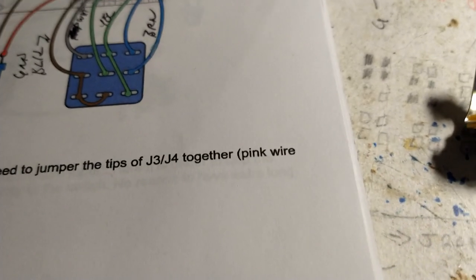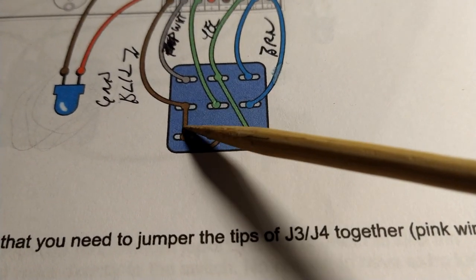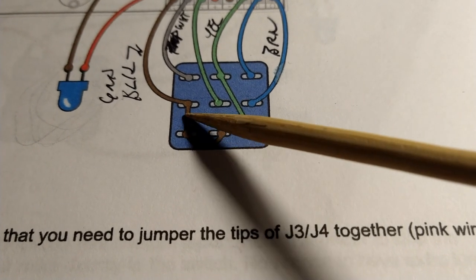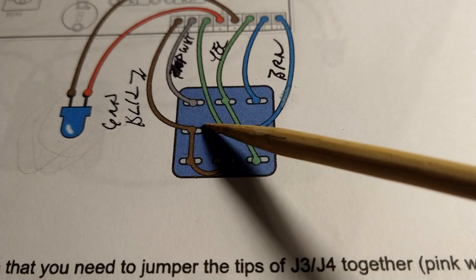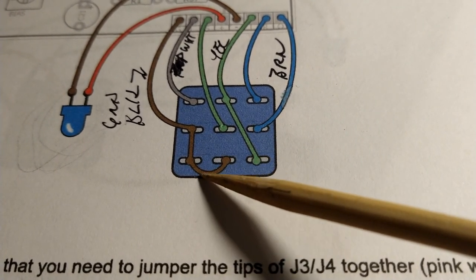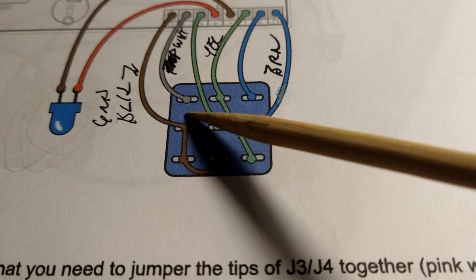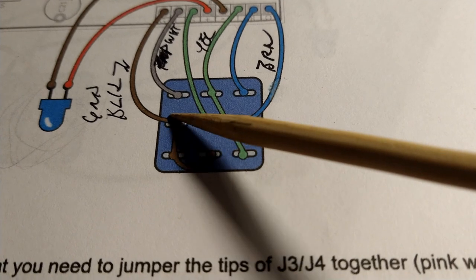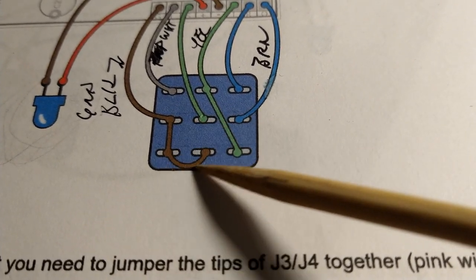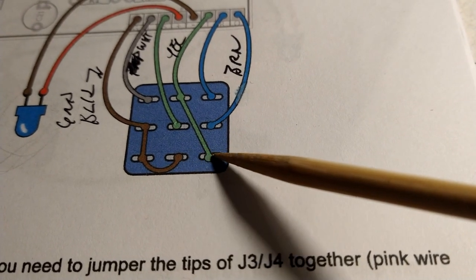I forgot to mention, you see some of these connections jumper from pole to pole. For these jumpers, I use solid wire. So we got one here, and I just cut the insulation right here. So this is all bare exposed wire, connected here and then passed through here, J-hooked around this guy and soldered, with this guy being stranded. And this guy the same way.